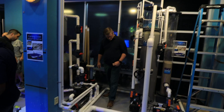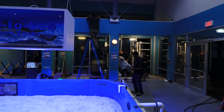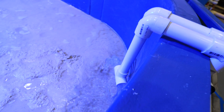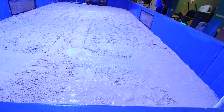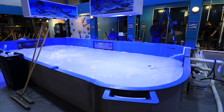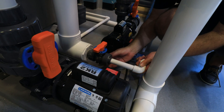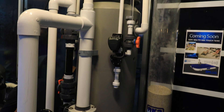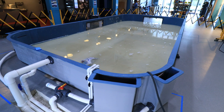Back at the touch tank, the final plumbing was being glued and laid so the system could start filling up. With the clean salt water line attached it was time to get the tank wet — the facility had made up roughly 400 gallons of salt water before our arrival but needed about 4,100 more gallons to fill it all the way up. With water going in, we called it a night and came back in the morning to button up the final plumbing needs before heading back north. A couple final PVC sections were glued in the morning and things were all wrapped up for the filtration system.